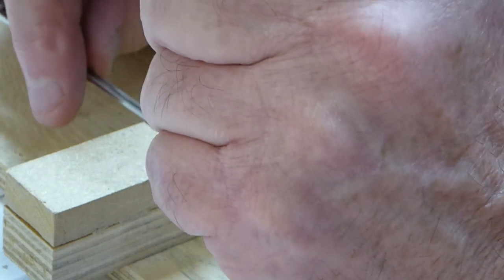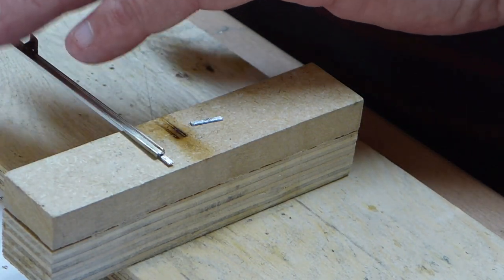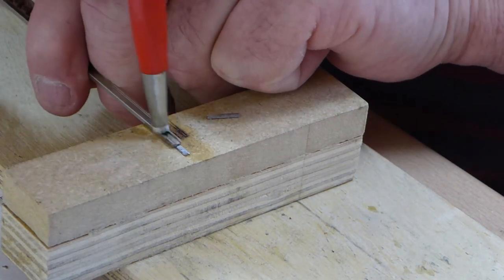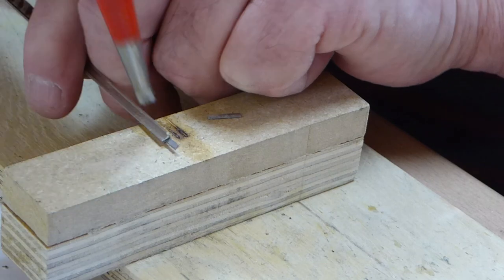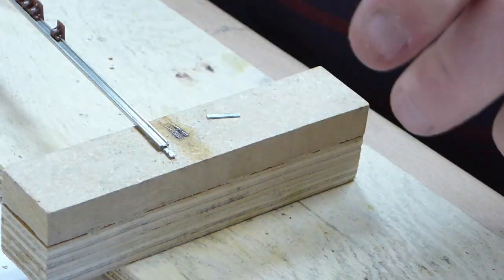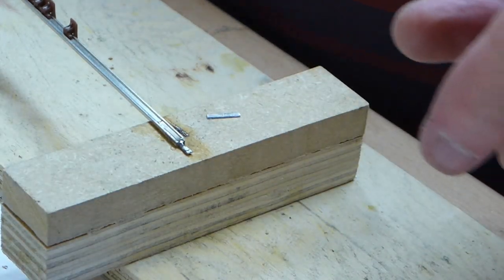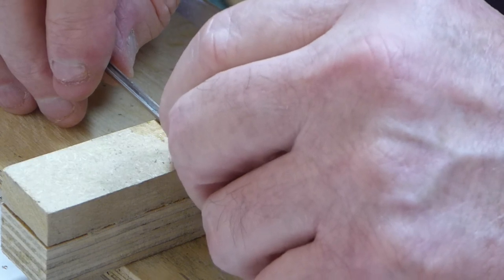Take it off, lovely. Turn it over. And I'm just going to clean again because we've dirtied it on the back of the block. The block's just singed it a wee bit. Just going to get that. Okay, nice and shiny. Top off the flux, brush in, flux on the rail once again. Don't need to put any solder on the iron, okay, because we've tinned the component to go on.